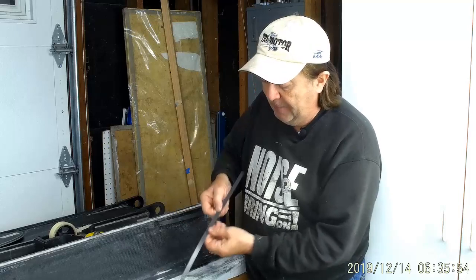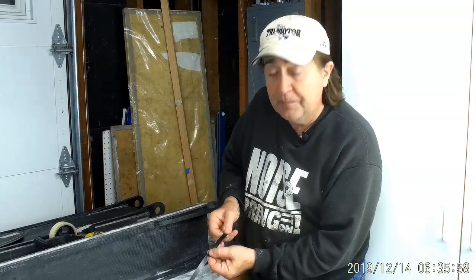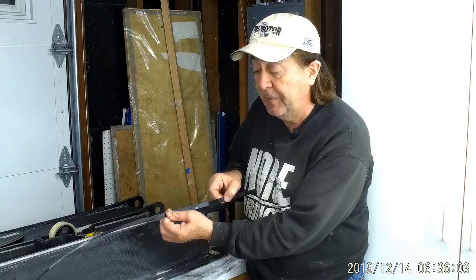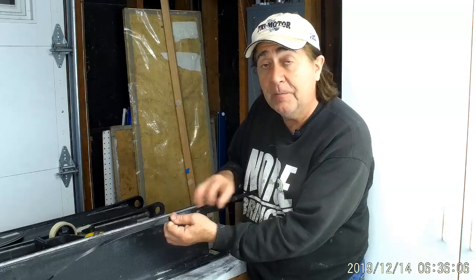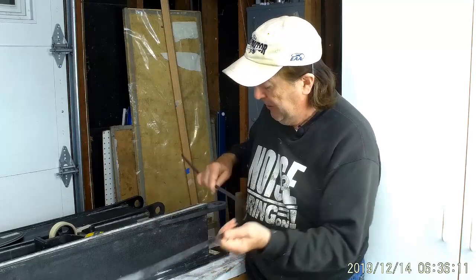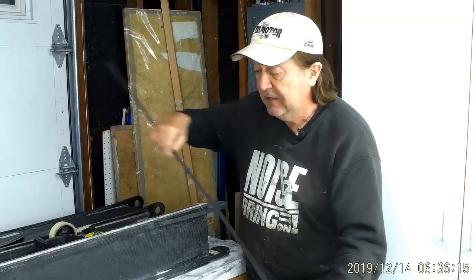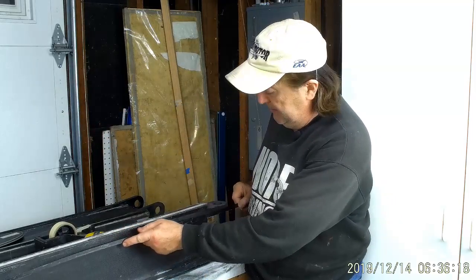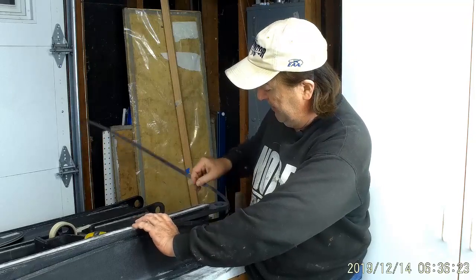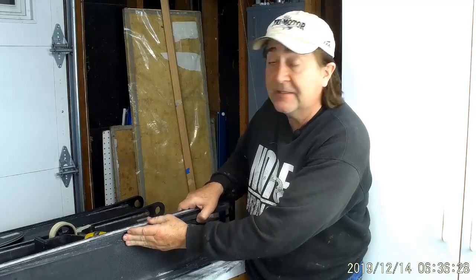Now, this happens to be actually 2 strips joined together here, and 2 of them together makes them a half-inch wide. I have them joined together with some clear plastic tape for the bonding process, and after I'm done bonding them, I remove that tape for final bonding of the parts. So this piece is 80 inches long, give or take a little, and it bonds on to the side here like this, and wraps around this fitting here, and of course it's springy, so it's going to stick out a little here, but it wraps around the fitting and then bonds down the other side.